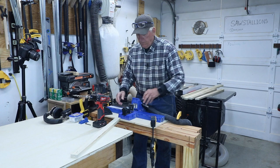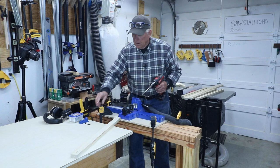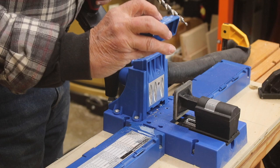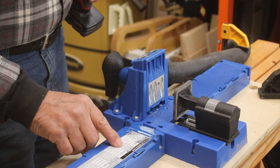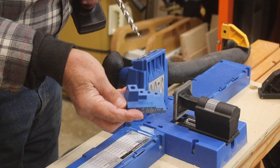The second thing I'm going to do is set the stop collar on the drill bit. To do that I take the provided little jig. This time you're going to go by the length of the screw. What length screw am I going to use for three-quarter inch material? There's a chart here — it says for three-quarter inch material, use a one-and-a-quarter inch length screw. So that's what I want to set it for.